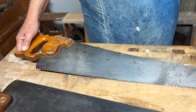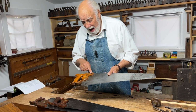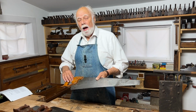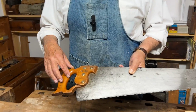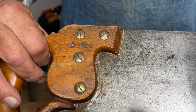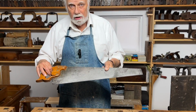A good quality hand saw can typically be told, amongst other things, by how many nuts it has holding the handle on. For a full-size rip saw or crosscut saw, that means that if you have 4 or 5 nuts, you're pretty guaranteed that this was originally, whatever the state you may find it in at a flea market, a top quality saw.